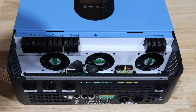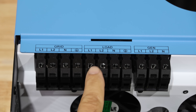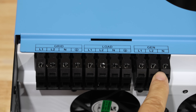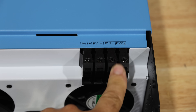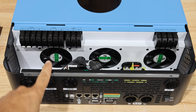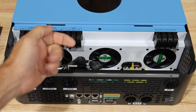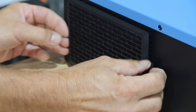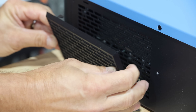Taking the cover off: on the left-hand side you have your grid connection and the output from the inverter, and on the other side you have the generator connection. On the right-hand side you have your two MPPT charge controllers where you hook up your solar arrays. Looking inside, you can see there are three cooling fans in the bottom, which appear to be blowing air down.